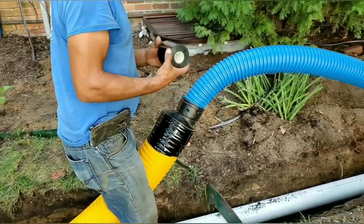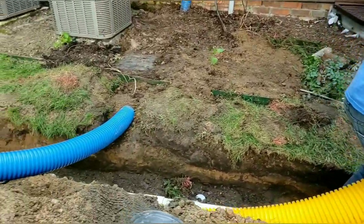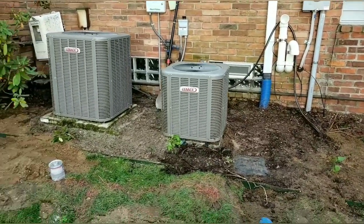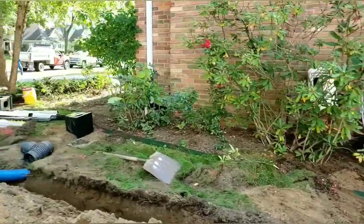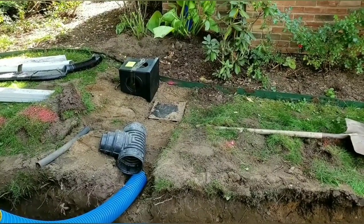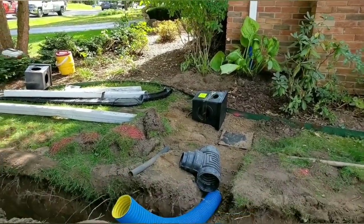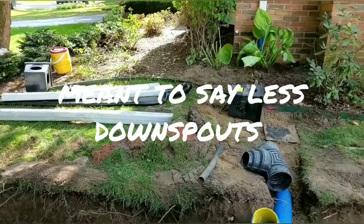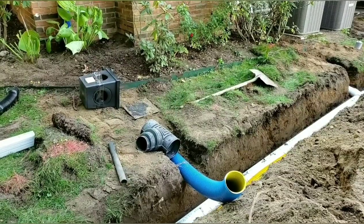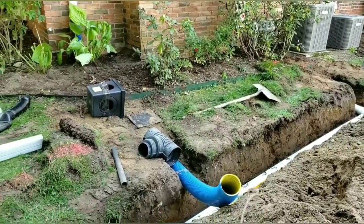So that's our two downspouts from the back are in the 4-inch pipe. Then we go to a 6-inch right away because we got our third drop right here, and we got our D-box right there for vacuuming it out, shop vac it out, and we got a fourth drop right here. And these are big gutters. When you go to the 3x4x4, you need less gutters on your house because they handle more of the roof runoff. So we're taking care of half of the roof runoff system while we're doing the sump line. So this is working out really well for the homeowner.